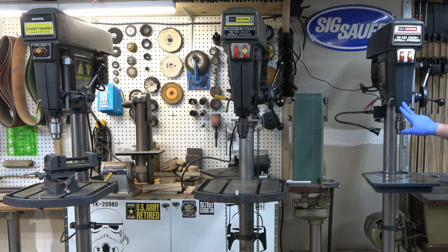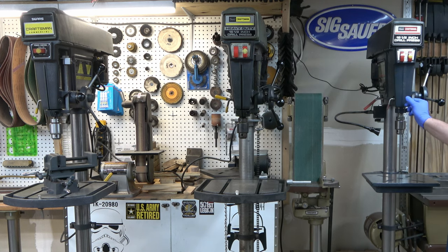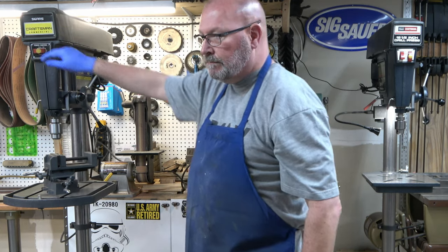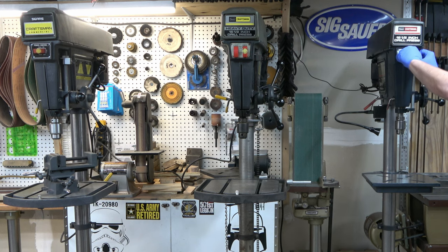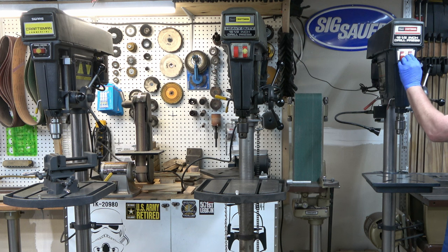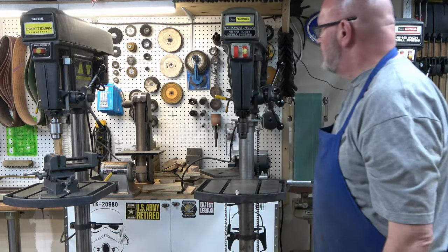The standard model has a solid head and the commercial models have a split head. There's a separate light switch on the other two, and then this Gen 4 just had a power switch that turned on the light and the drill press itself. All of the motor switches have the safety lockout feature on them, and that's one distinction between the Gen 3 and the Gen 4. The safety lockout switch was introduced in 1972 with what I'm calling the Gen 3.5.